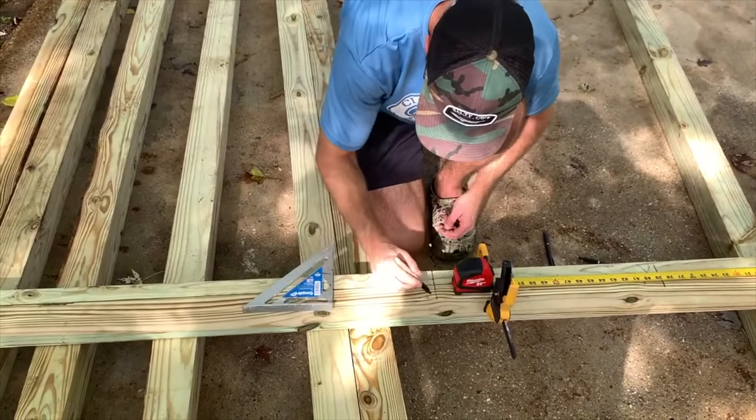After trimming 6 inches off the first shingle in the second row, you're going to want to position it so again, you have the 1/4 inch overhang over the rake side drip edge, and so that the bottom of the shingle is in line with the top of the wide cutout. What I'm showing you here is how in the field, the bottom of the shingle installed above should be completely lined up with the wide cutout of the shingle below, as shown.